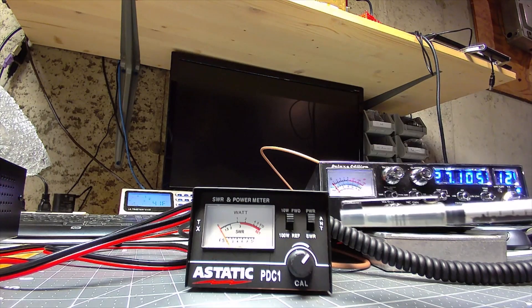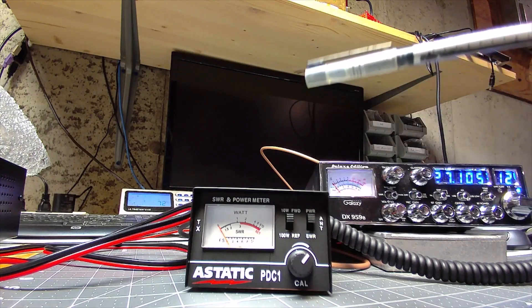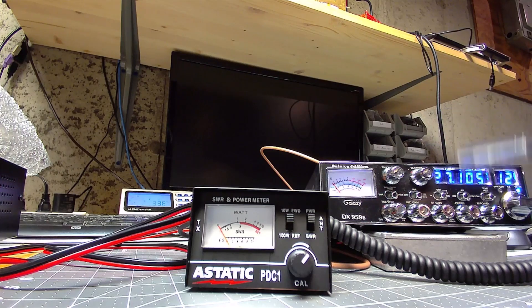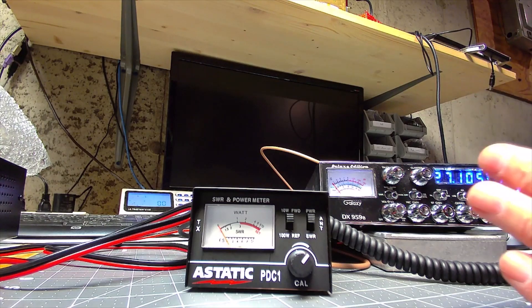This is a good little piece of equipment for an operator to have, to triage his radio. Without an O-scope, without a modulation meter, knowing that I'm getting reports and my radio is modulating, and people are saying you're reasonably loud — we're probably somewhere around 100% or more. Someone says 'God, I can barely hear you,' you're probably not modulating to 100%. I'm talking triage here, not going into business, not opening a laboratory.